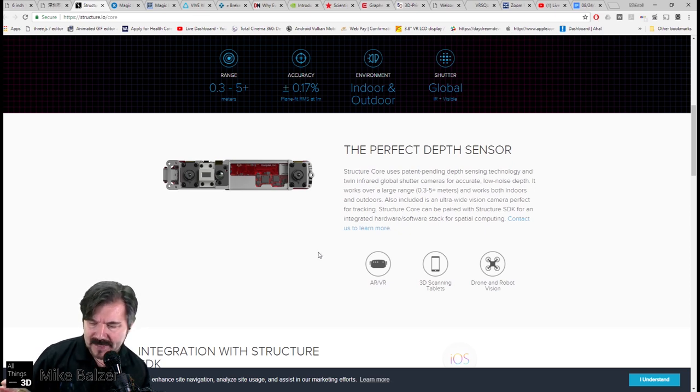If you look at other camera systems that have the IMU built in, they're about $300 all the way up to $500. Normally they're stereo cameras. The cool thing about the Structure Core is that it includes two stereo infrared cameras — the two outside — a wide-angle RGB camera in the middle, and the actual structured light emission device, which is like the dot pattern used in the iPhone X or the Kinect — a very small compact chassis that also provides heat sinking.